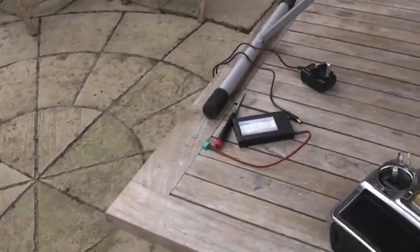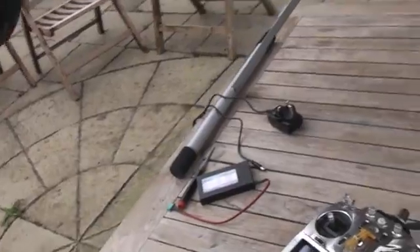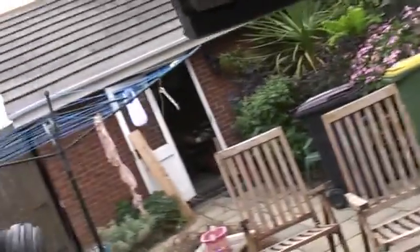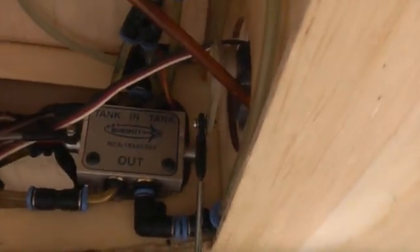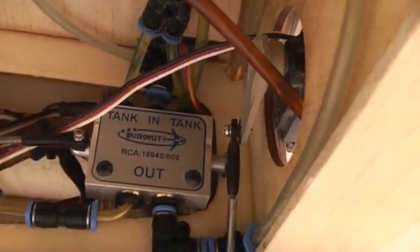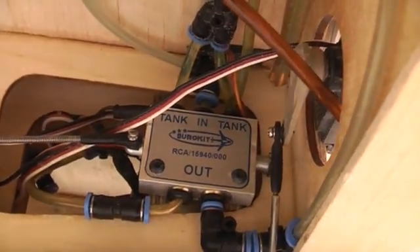This is a video regarding the hydraulic mechanism used on the Jerry Bates quarter-scale Sea Fury. Both systems — the undercarriage and flaps — are driven from a hydraulic pump, which supplies fluid to a Eurokits five-way distribution valve operated by a servo. This particular valve is the undercarriage one.